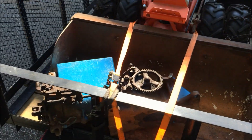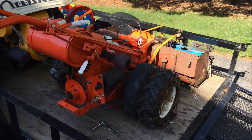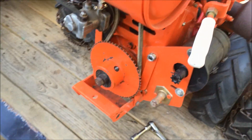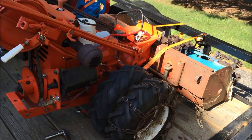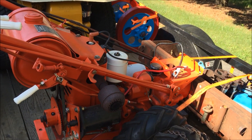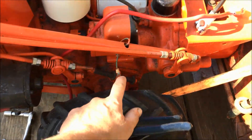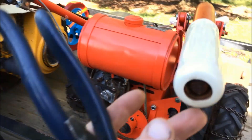I decided to do a little work on this 63 L8 before I put it away. As you'll notice there's no starter chain or anything, and when I restored this tractor a couple years ago I never got around to hooking up the electrical parts. In an effort to clean my garage, I realized I have all those battery cables sitting there, so I'm hooking up the battery cables now. Down here the magneto was never hooked up to the kill switch because the old kill switch doesn't work - it's just dead.